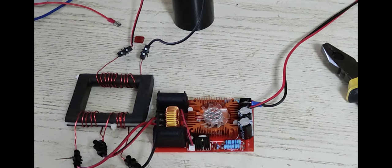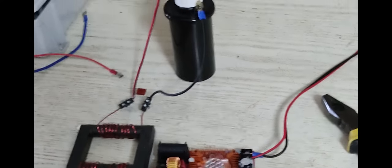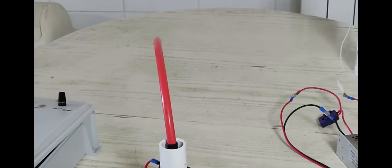If I use the capacitance I calculated to make the primary and the secondary matched resonance, it says I need, because of this, that I need 3 microfarads. I tried that. Thing doesn't run at all. It runs fine without this, but it seems to have a slight bit more current with this, so I have it on there now. But again, it's not necessary. And enough of that, let's watch and see what kind of arcs we can get out of it.